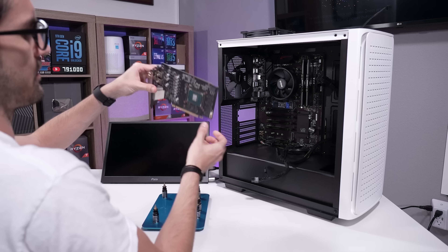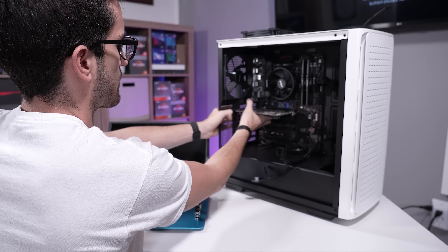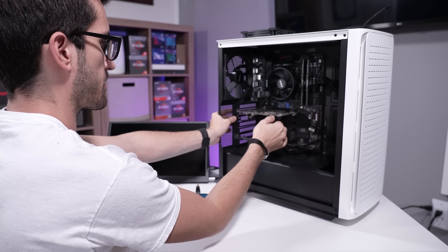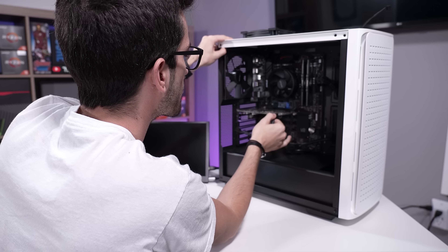Just going to keep flicking this on and off to make it as gradual as possible so there isn't any sudden shock to the board. Temps are still pretty high. Off to the bottom right there are a few blemishes on the die that wouldn't come up with IPA — I'm not sure what those are. If there are surface defects in the die, that could affect the integrity of the card and explain why we're not getting a picture out at all, even through VGA drivers for a post. If the odds of the 7770 being fixed by reflow method were low to begin with, this is going to be even lower. I'm saying less than 5% chance this gets fixed.